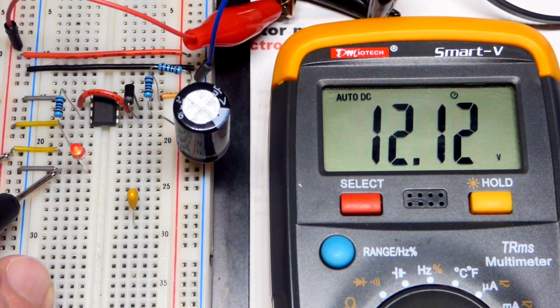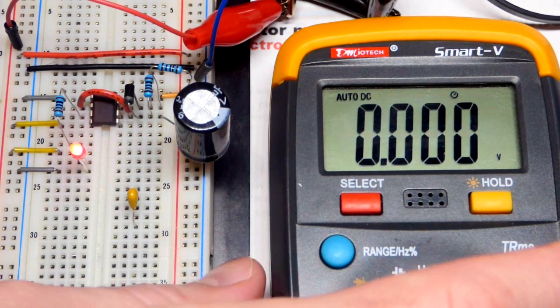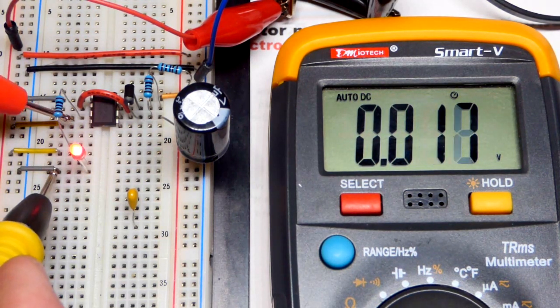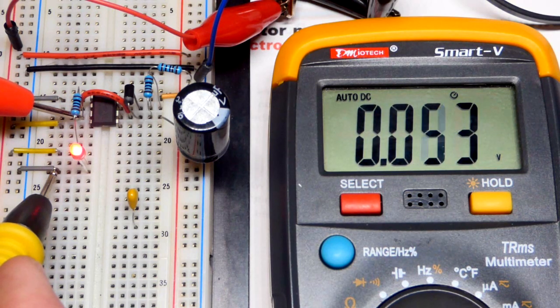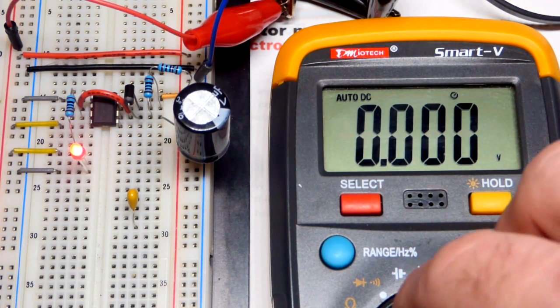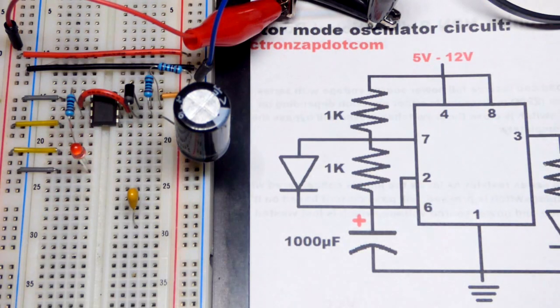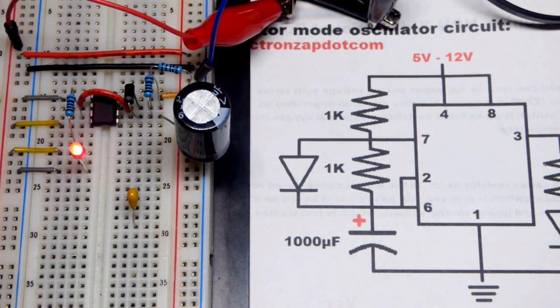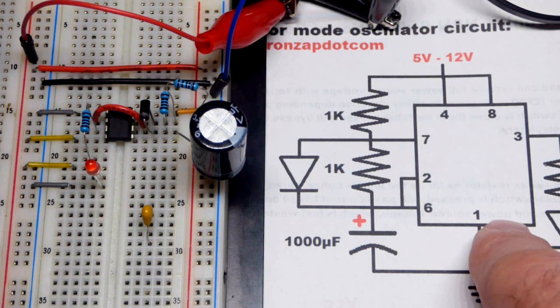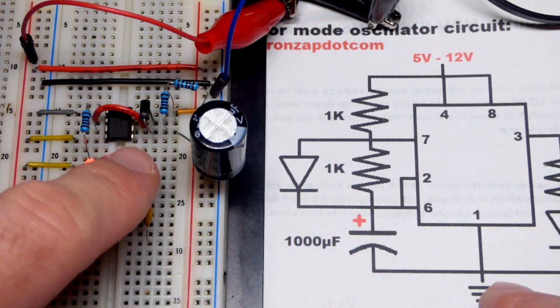Going a little above 12 volts you can see the LED is brighter, but notice a problem - the LED starts lighting up partially before fully lighting. We went to 15 volts. Let's look at the rail. That meter won't cut it - we'll have to look with the oscilloscope later. First let's address another thing: there's that flicker too. You can see it starts lighting a little bit before it fully lights up, and that happens with my bench power supply in this setup.